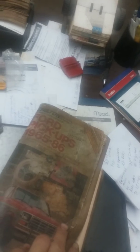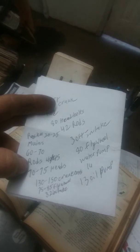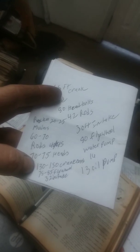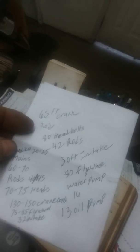If you're a novice and don't understand a lot of this stuff, get yourself one of these books — a lot of them you can download on the internet, or just call me. I went through the book and made myself some notes, a little cheat sheet. I can go down through it and check my main bearing bolts, rod bearing bolts, head bolts, crank pulley bolts, flywheel bolts, and so on and so forth all the way down to the rocker arm bolts.